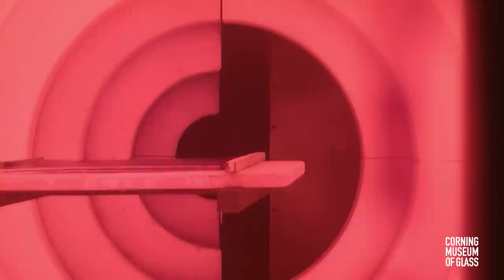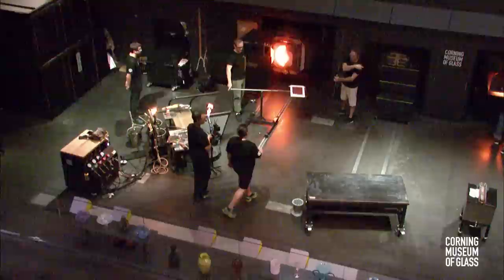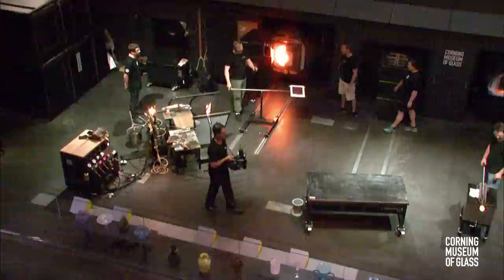So what David's doing right now with Ian, David has laid out a sheet of these little discs in a rectangle form. And since they're round, he's going to squeeze them together. So he heats it, then he compresses the pattern using those ninja swords, it looks like. But they're just basically big pieces of steel. And that's a tool he actually built himself using some Damascus steel that a friend of his made. So he squeezes them together with those paddles, and he's compressed out the little corners that were left empty because these are discs, where there would be empty space.